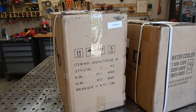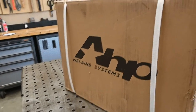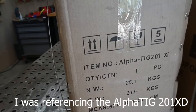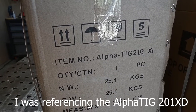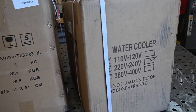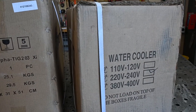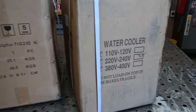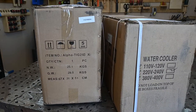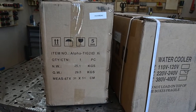Today we're going to be unboxing my new TIG welder. I have an Esab Rebel AC/DC TIG welder — actually, decided to go with the AHP this time. Their Alpha TIG is a really good machine, and this is their new Alpha TIG 203, 200 amp, AC/DC capable. They also have a water cooler made for it, and I've welded with water-cooled torches before — they're amazing. I believe this package ran right at $1,100 shipped. I am not sponsored; I paid for this out of my pocket.